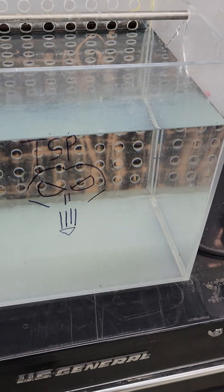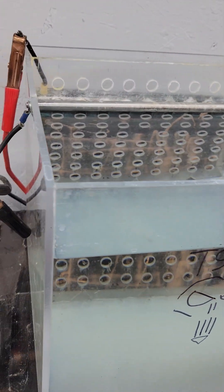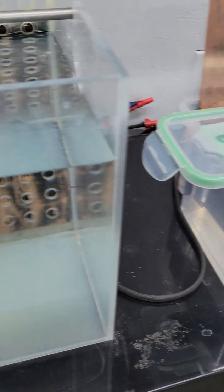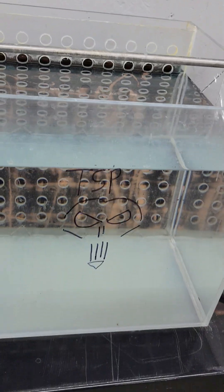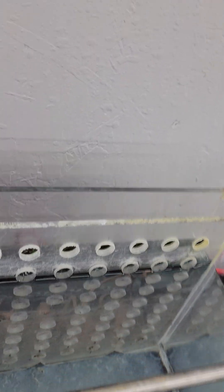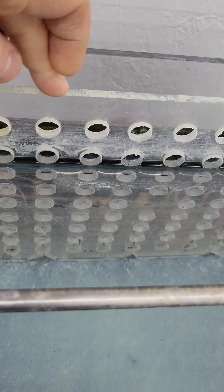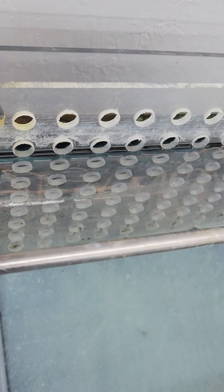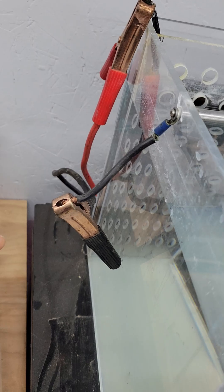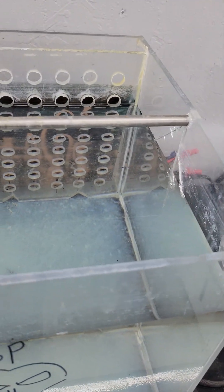As a mechanic I'm used to positive and negative, but you have anode and cathode — cathode is the negative. I have the wires netted on so I can move them between the blackening tank and the regular anodizing tank. The nice part is if you get them swapped, it just won't anodize — no big deal, just swap the leads. My cathode is behind a protective barrier so I don't arc out on it — it's just a big copper plate. I also have a piece of 17-4 stainless steel for the anode bar, connected to the outside.